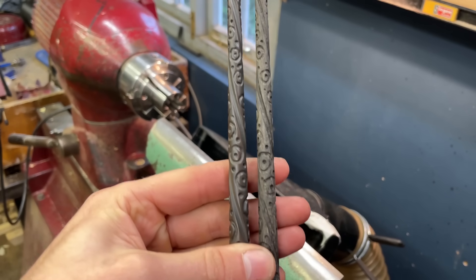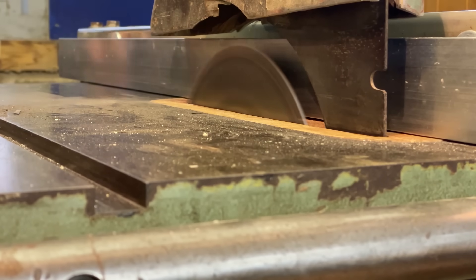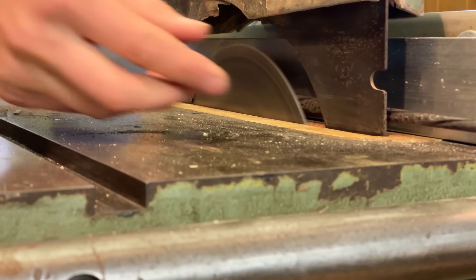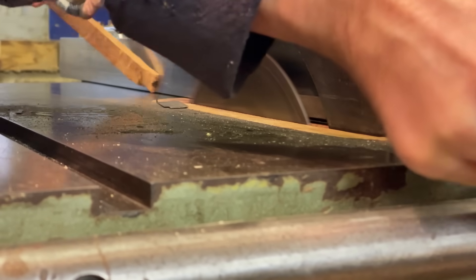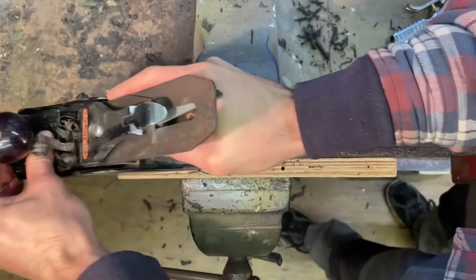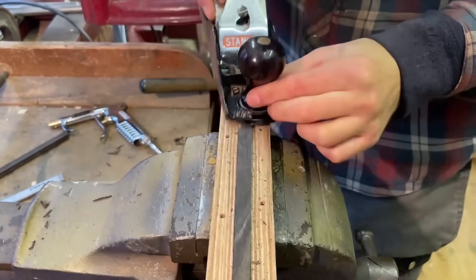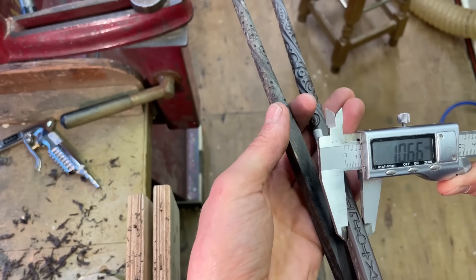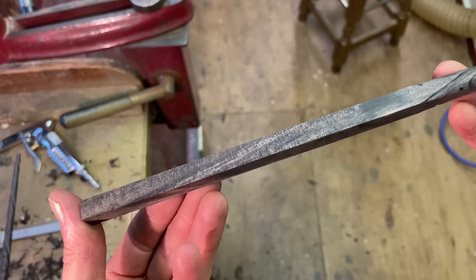This shaft always reminds me of tentacles — sorry if you can't unsee that now. The next step is to trim off the bottom of the handle and I'm being very careful here. The push sticks are just an extension of my hand and I'm standing well to the side in case of any kickback. We're still slightly oversized so I'm just using the hand plane to take off some material — this is the sharpest I've had a plane for a while. We're now slightly undersized but only by about 0.2mm, which is about two sheets of paper, but just look at that surface finish straight off the tool.